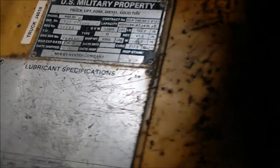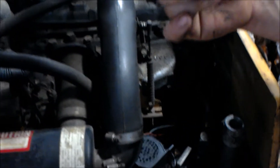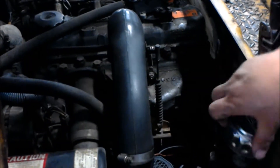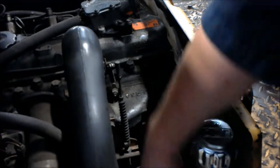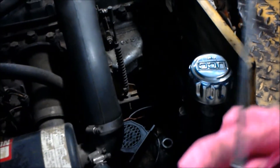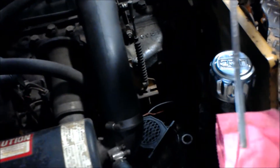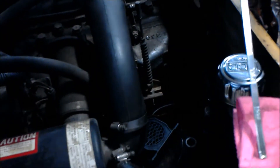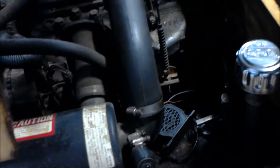What I'm going to do now is lift this up and inspect where the engine is. Over here is the hydraulic breather — not only is this a fill cap, but it's also a breather. It's a little dirty but nothing too crazy right now. We're going to put this cap back and check our hydraulic fluid. We're not quite at the add mark, but we're a little low — for all intents and purposes, we're pretty good for now.